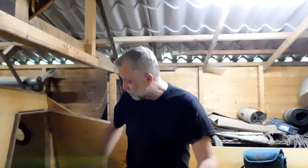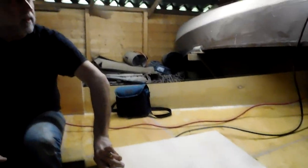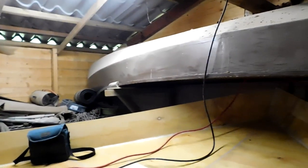And it's very good. And now, of course, we're to the stage of the aft deck that now these deck boxes can be finished. The frame around the lazarette can be constructed. The frame coming around here that the hatch shuts down onto. Probably a piece of hardwood of some sort going back there with a deck cleat on it. Those things can be fitted. The trim around the main entrance hatch go on. All those things can be done, and then we're ready to paint her, which is pretty exciting, really. That's where we are. Big progress this week.